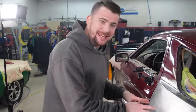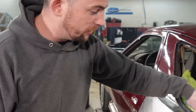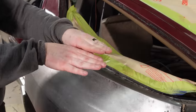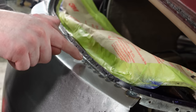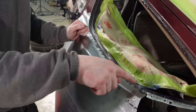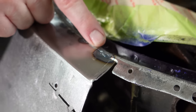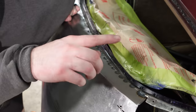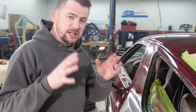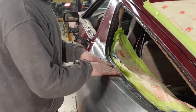A big key to success when welding custom panels onto your car is to make sure your two panels — the panel you're putting on and the parent material panel — are both lined up perfectly. They shouldn't be overlapping either way throughout the entire seam, because as you weld across and it deviates up and down, it causes twisting. Every weld you make shrinks, so even these tacks: if I tack and go, tack and go, it's shrinking and pulling the panel closer as I go. I need a nice clean butt. I need to hammer and dolly all these tacks and grind the tops off so they're nice and consistent and smooth — that's the key. Every stage through your welding process needs to bring things back to a nice, copacetic, level plane. If it's not smooth and then you weld it expecting it to be smooth afterwards, you're magnifying everything that's wrong by about five.